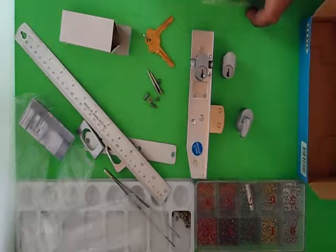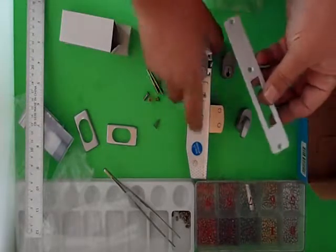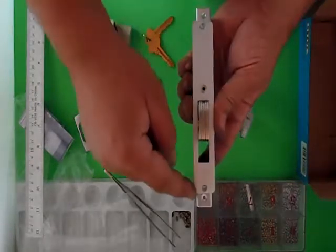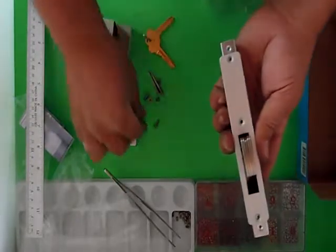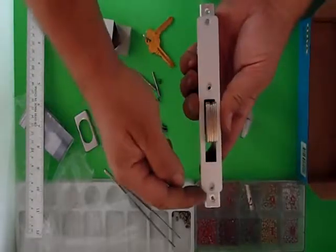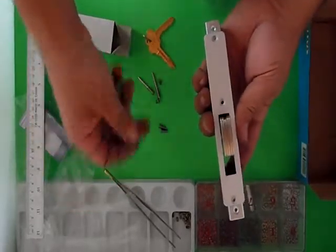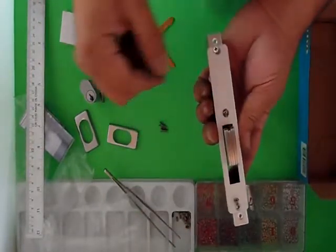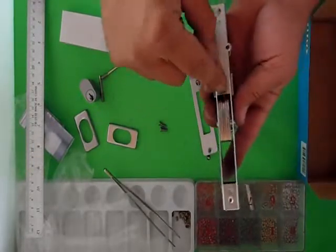This lock does not come with a striker plate — it comes with a face plate, which simply sits over the top. When fitting to the door, you'll see the cutout for the face plate and a hole above and below. The two long screws are used to hold the lock to the actual door. The small screws go in to hold the face plate on. Use the small screws for those — if you use the wrong size screws, it will affect the bolt retracting all the way.